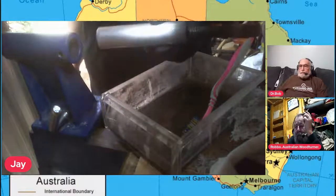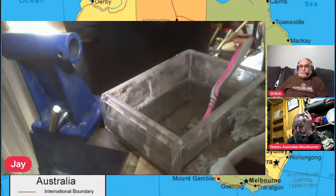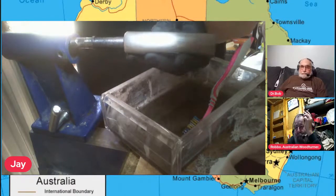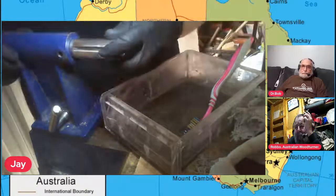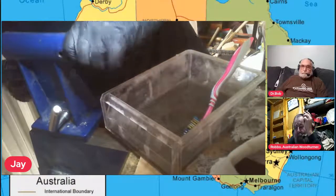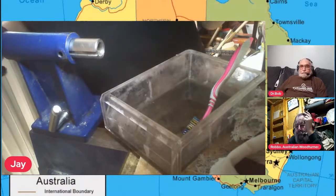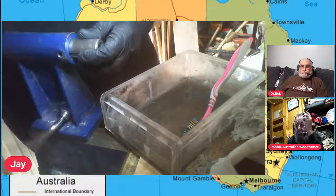Right, now insert that into the, no, other way round. Insert that into the tailstock. The right way round. No, the right way round. That way. Right, put it in. Yeah. Right, now have you got the threaded bit all the way out the outside now? Have you got the handle end out? Yeah. Rightio. Now, put your spindle lock in. Screw that in. And make sure it's sitting in the groove.